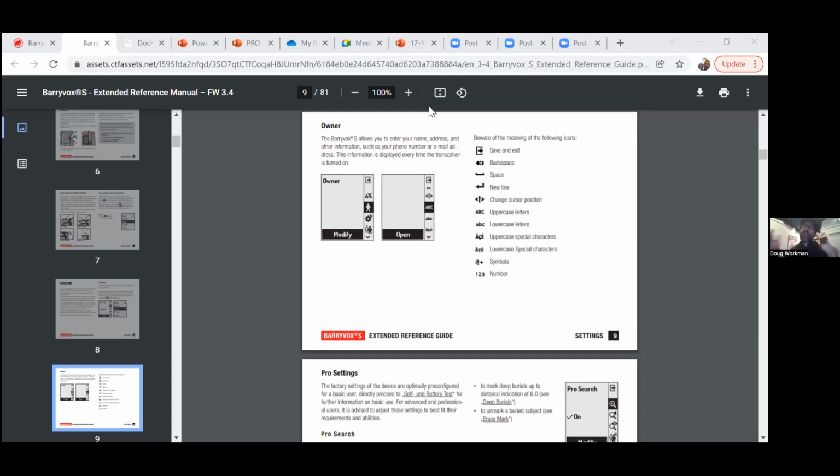Now, when you do a group check in group check mode, you're not only testing that the beacon you're testing has a 457 signal, you're also testing that the strength of that beacon is adequate, because your receiving volume, so to speak, has been turned down so low that if you're at a meter and you can hear it, it doesn't just tell you that that's a 457, it also tells you it's a very strong, good signal. So you're testing the integrity of the signal as well as the accuracy of the signal.